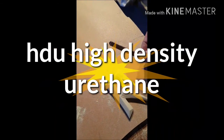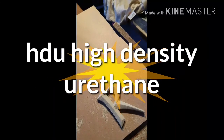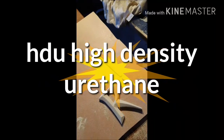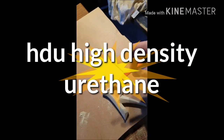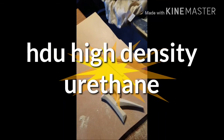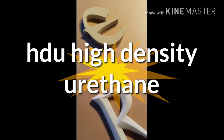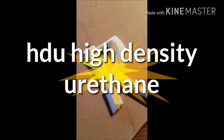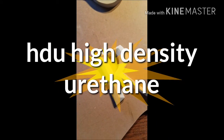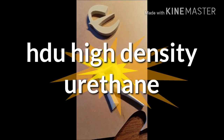And then you work up from, you get everything done like this with a 60 grit, then you go down to more of an 80 or 100 grit right here to smooth that out, and then you finish up with a 320 grit, which makes them really nice and smooth, like this guy here. See how nice and smooth that is? So when you go to put your size on there and your sealer and your gold leaf, you're going to have a nice looking letter. The smoother you get it, the better gild you're going to get.